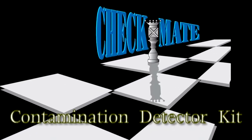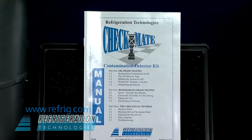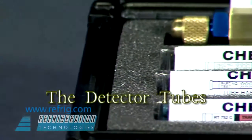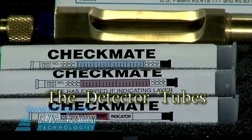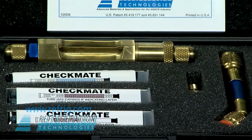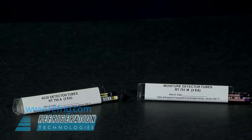The Checkmate method is a quick and easy way to determine the amount of acid or moisture in both refrigerant and oil. The detector tubes are the heart of the Checkmate method. The acid and moisture detector tubes are used to test refrigerant that has to be recovered, recycled, or reclaimed. The acid and moisture tubes will help determine if the gas is clean enough to be reused.